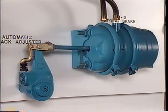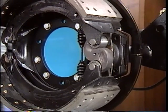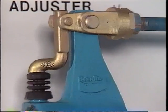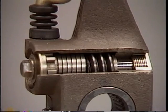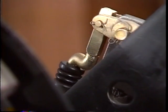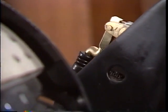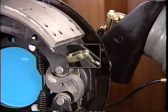When the brakes are applied, the brake actuator's push rod causes the slack adjuster to rotate the brake camshaft, which begins to force the brake shoes into contact with the drum. As the slack adjuster rotates, the yoke assembly pivots on the yoke pin, causing the adjusting link to be pulled upward. The travel of the adjusting link actuates the internal adjusting mechanism. This adjusts the brakes before the shoes contact the drum. All adjustment ceases when the shoes contact the drum. The ASA-5 senses or adjusts to a running shoe-to-drum clearance, not a brake chamber stroke. Over and under adjustments are therefore less likely.